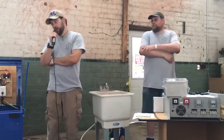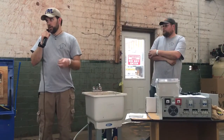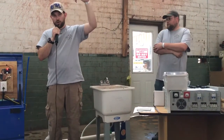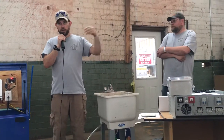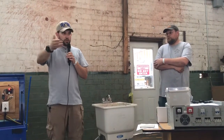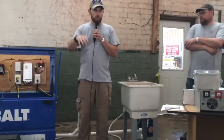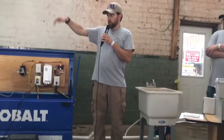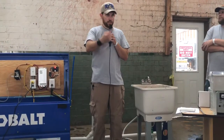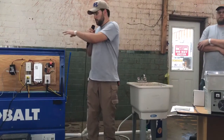And also that's why the flow jet pump is so large. Say you live in a rural place, like you've got a farm or whatever, and you've got a well. The type of unit that we've got is such a heavy duty unit. It sits on a large pressurized tank for pressurizing, suctioning, and output pressure as well. So we kind of oversize the pump for such a small structure, but at the same time, if you get in a scenario where you're like me and you set your water station out away from your house, it's quite a distance to travel. Then keep in mind you're pressurizing the hot and the cold side, so you're splitting your feed, and then you're going through a hot water heater too, so that meets that demand.